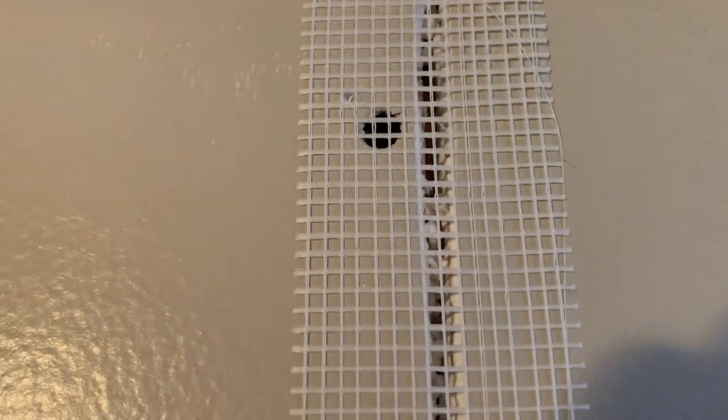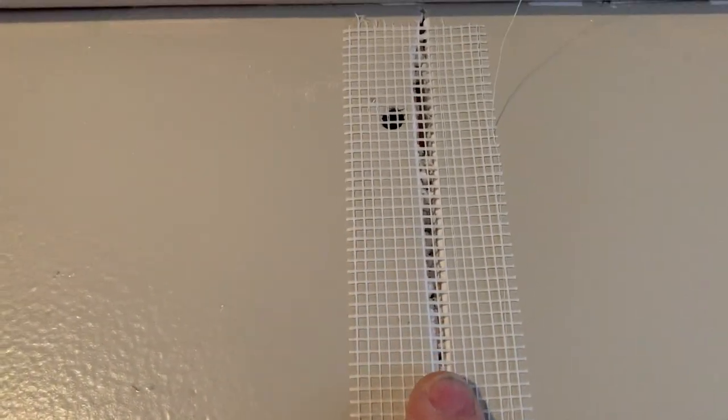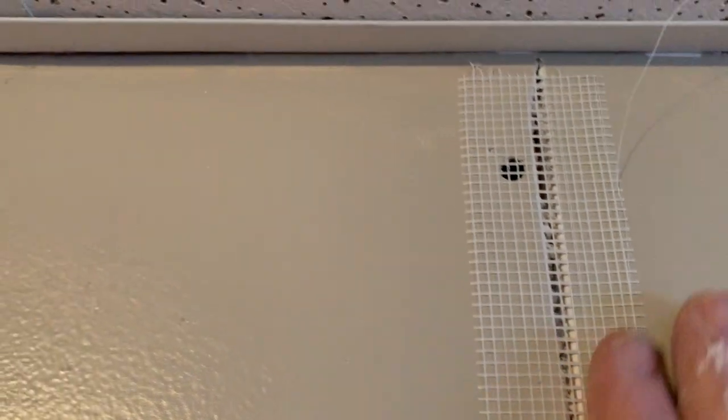What people make a big mistake is they put the tape over a big gap and then they'll smear a couple coats of mud over it, but it truly doesn't work into that void. What you need to know about drywall is anything that's hollow will typically crack if you leave it hollow. If you just float a little eighth-of-an-inch skim over top of it, it's probably not going to hold — it's not guaranteed.